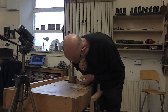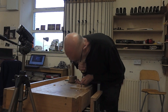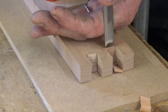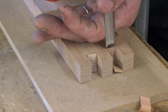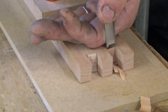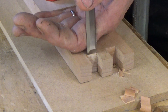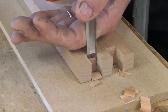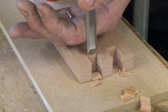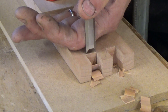I just put my body weight down onto it — so it's rather like where I was paring the other way, I'm using my body weight to drive the chisel. I'm angling it slightly so there's no danger of undercutting, and working my way back until I can get the chisel into that gauge line and clean up the corners. I've sawed out the waste with a coping saw. You can see the action: I've got a stabbing grip and my index finger and thumb controlling the way it's going in, with my body on top of the end of the chisel.